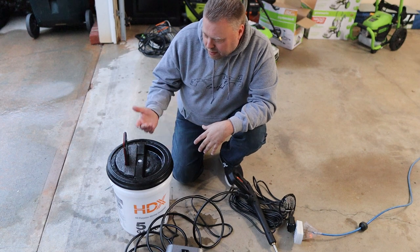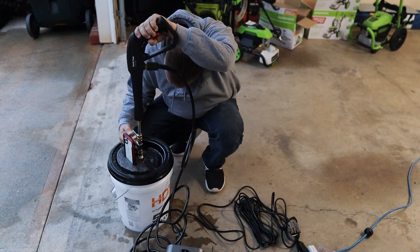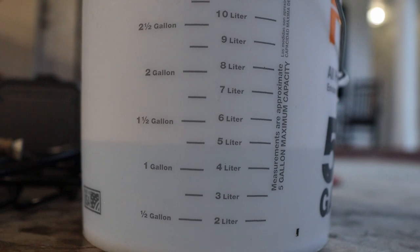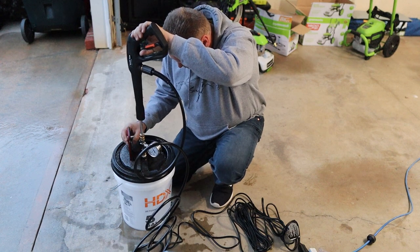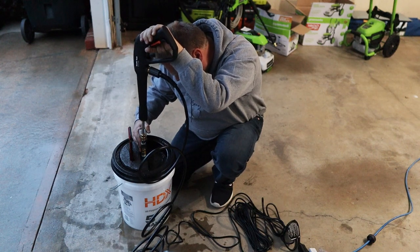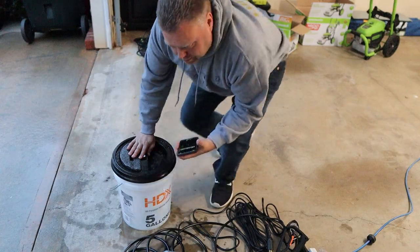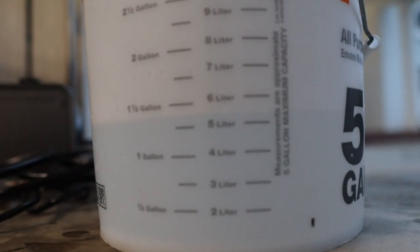Let's see what kind of GPM we get — we'll fill the bucket up for one minute and measure what's in there. We are getting about 1.25 gallons per minute at that 1000 PSI, steady at about 975 to 1000. Now the 3.0 nozzle — one minute on the clock. We were at 750 to 800 PSI the whole time, a little too low for an initial rinse but probably enough for a final rinse. GPM with the 3.0 nozzle came in between 1.25 and 1.5, roughly 1.35–1.4 gallons per minute.